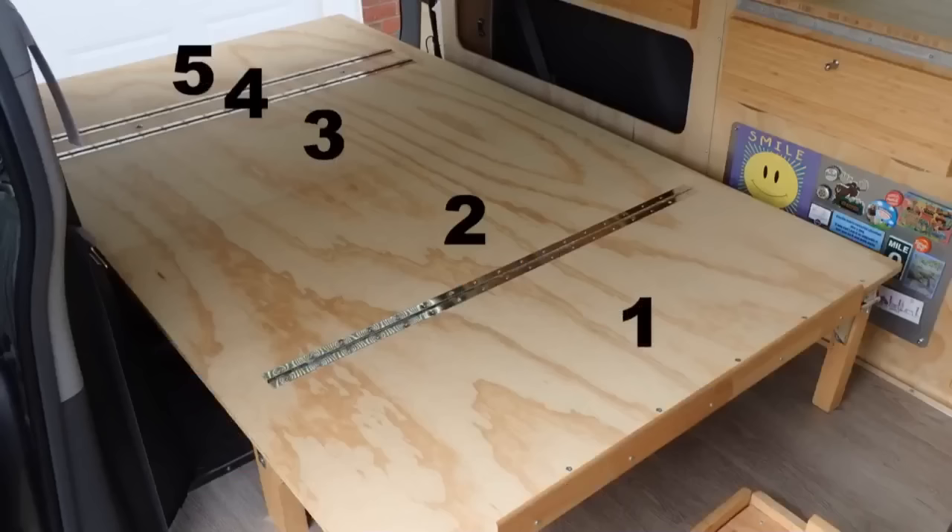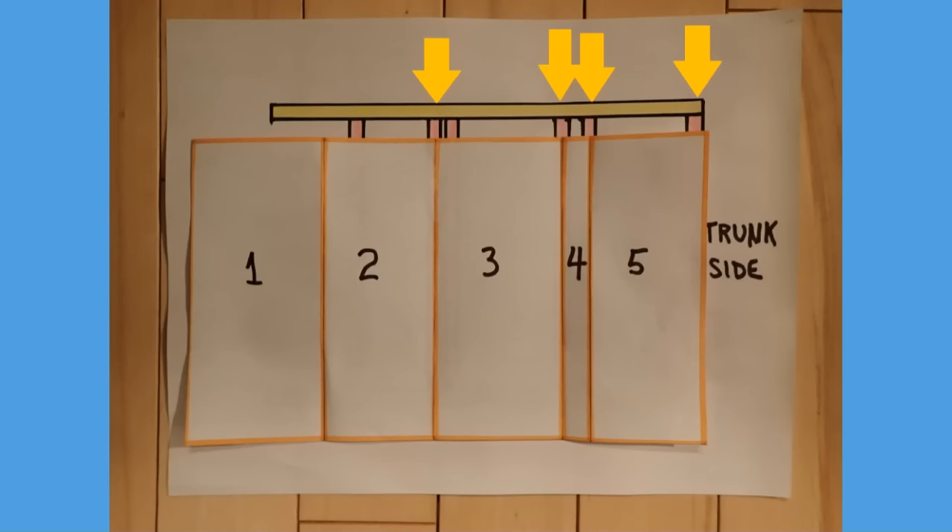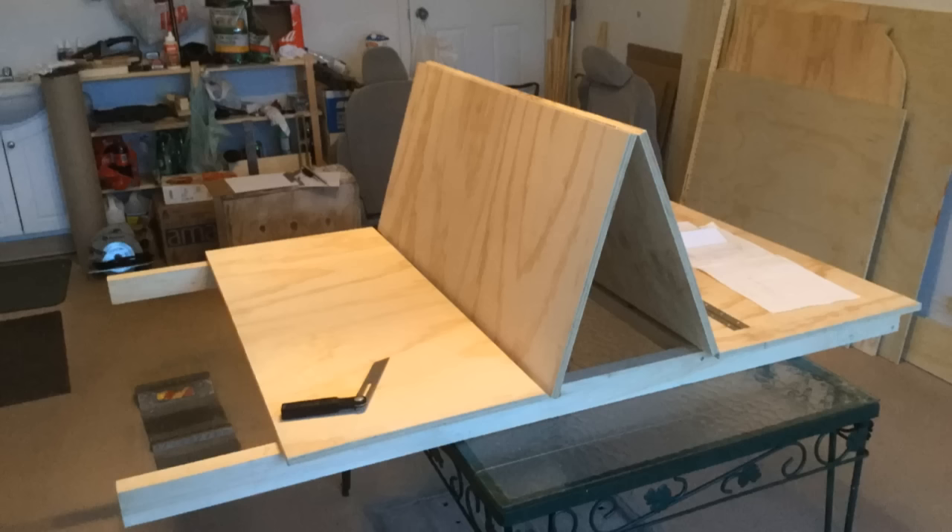As you can see, it's pretty easy. After that, you just have to link those panels with the piano hinges. Like with the cabinets, at first you can do a dry run with cardboard to figure out if everything will be as planned. Then I built the flat bed structure to fit the piano hinge positions in bed position and in sofa position. You can try different sofa angles to find out which angle you prefer. That way, you'll be sure where you will have to fix your across stud structure.